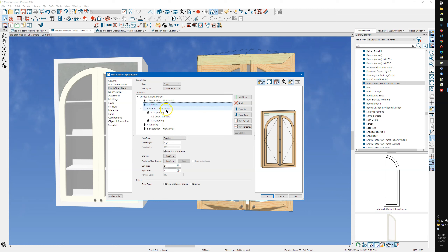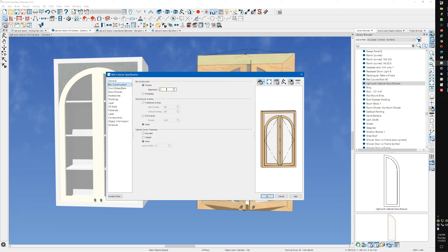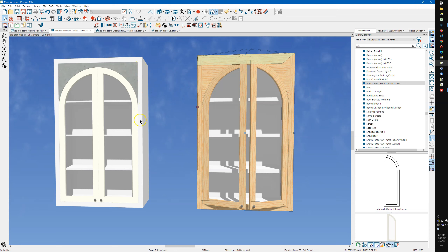The layout has a quarter-inch opening on the left, a quarter-inch opening on the right, the door in the middle, and a quarter-inch opening at the bottom, with a rail at the bottom. All standard cabinet stuff — no fancy symbol manipulation. This is a framed cabinet with two-inch stiles and rails, inset, all pretty standard. The other cabinet doesn't have that gap for the molding. You can select the molding right there — it's just a 3D molding polyline — and I'll show how I generated it.